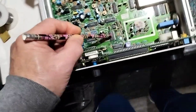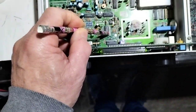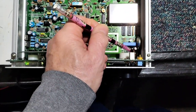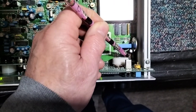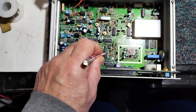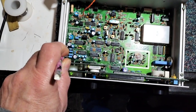The TDD 1724 produces an RF carrier which is actually rectified by a couple of diodes — I think it's these two here. There is a resultant voltage from that which goes into the regulator and also up to here, but it's high. We should have 6.1 volts on the emitter of this regulator, but in actual fact we've got 6.6, and it's quite critical. Initially it was about 7 volts; the two capacitors and the transistor each brought it down marginally, and changing the three brought it down to 6.6. But the output from this chip is high when it shouldn't be — it's just the internal circuitry of the chip — so I think the chip has also been damaged by the high voltage from this regulator.